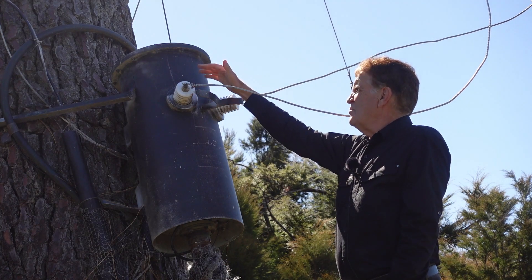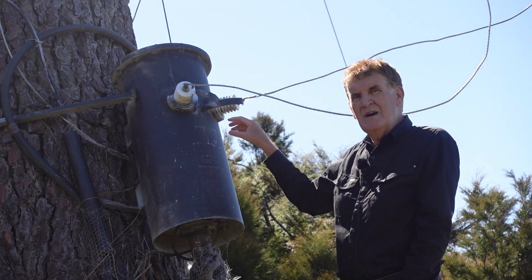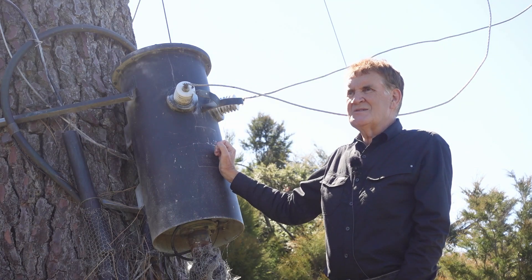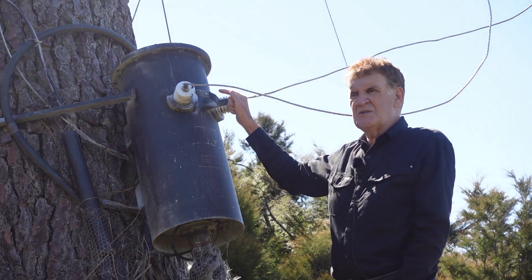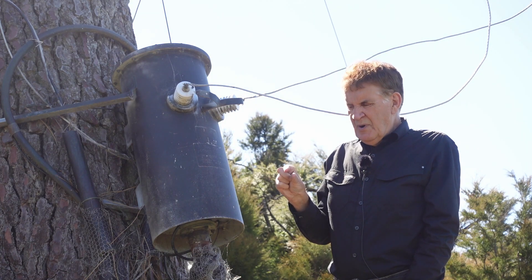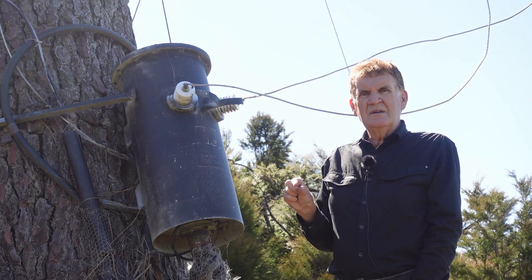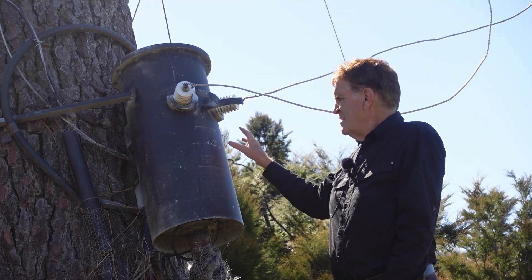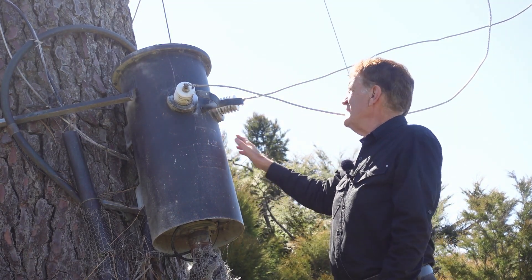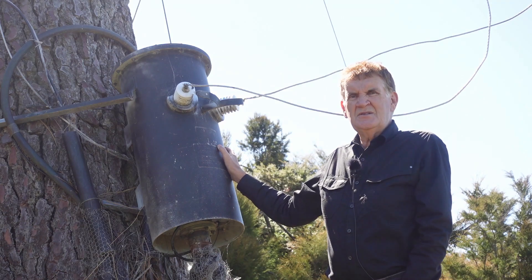I've got lightning probes here, though they probably don't really do much because internally — both the 50 ohm side and the 600 ohm side — are at hard DC ground. If you put a multimeter across there it reads zero in a big way. The cabling inside isn't really cabling — it's solid pieces of copper strip, probably 10 to 12 millimeters thick solid copper, which is quite substantial. It took three people to lift it up here, and I've been using it for probably 12 to 15 years now, and I get pretty good reports.